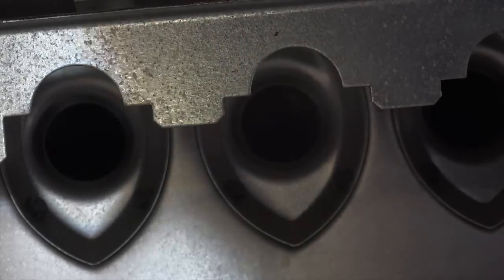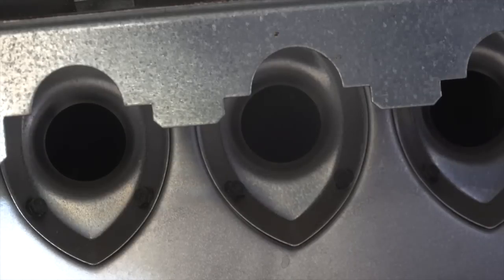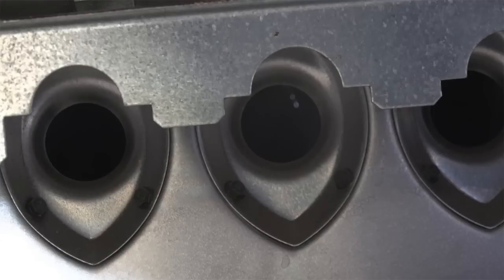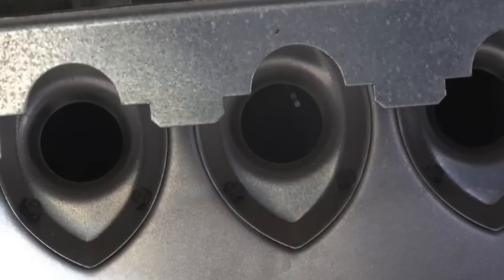Okay, this is the only way I can show this crack. You see that little light there? I'm actually shining a flashlight across the heat exchanger, so you can actually see the crack right there. Obviously the duct board would have to be taken off before you saw that, but that's the only way I can find that thing.